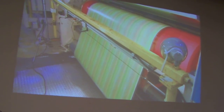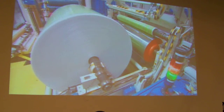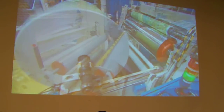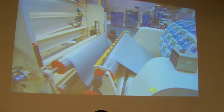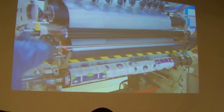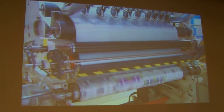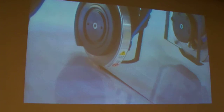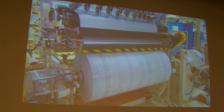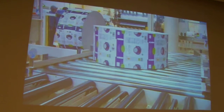The printed paperboard, with all its protective layers applied, then comes off the back end of the laminator into a large master roll. The operator threads it into a cutting machine called a slitter. It cuts and winds the printed material onto individual rolls. The slitter's knives cut the material into 4 lanes, each of which becomes a smaller roll. The operator trims the excess material from each roll. Then a conveyor system sends the rolls for shipping to a packer to be filled with their product.